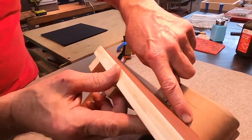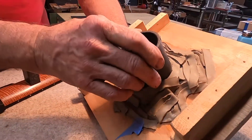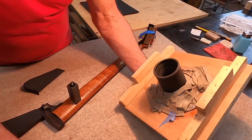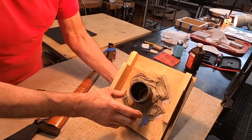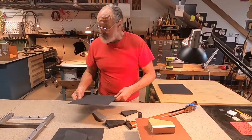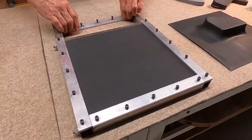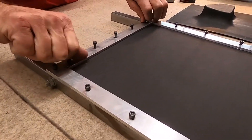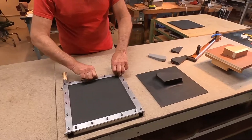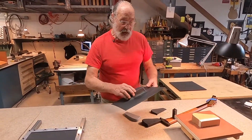You can see there are saw cuts underneath here, and there's a vacuum cleaner fitting here. This is some sticky vacuum tape that I used to seal — you could use other things. This seals pretty well and it works out okay. So we start with this piece of material and it goes in this frame that we made. This gets screwed down so that it grabs the material all the way around. Then we're going to heat it up. The cool thing about this is that it is kind of a vacuum bagging operation, but the bag and the part are the same thing.